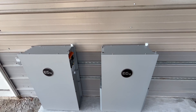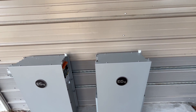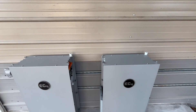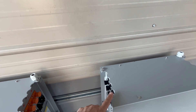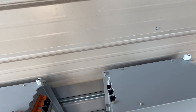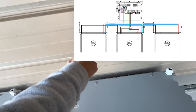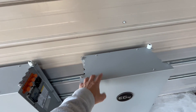I've got wire ways that come for the top of these. I'm going to do three of those instead. The quote I got on the wire way I was originally going to put here was actually incorrect, and the one I wanted was going to be more expensive than just getting the separate wire ways. They have little grommets and everything to go in here, and the other ones are made to go on top of this so it's easier. I'm going to have a piece of conduit in between each battery to run the cables through. This is going to be the master, and each one is going to run to this first, then through that — the bus bars are going to support all three and then run into the inverter.